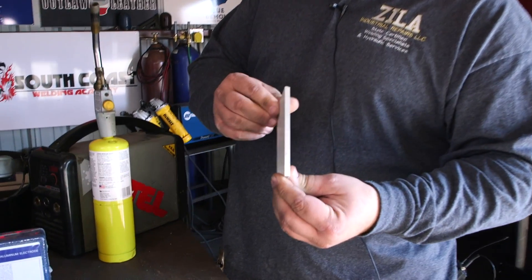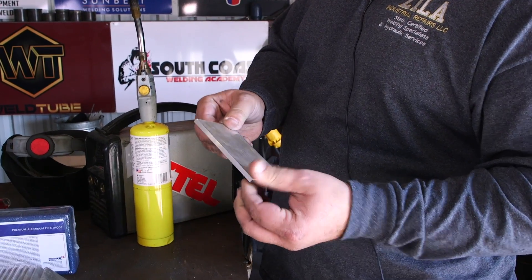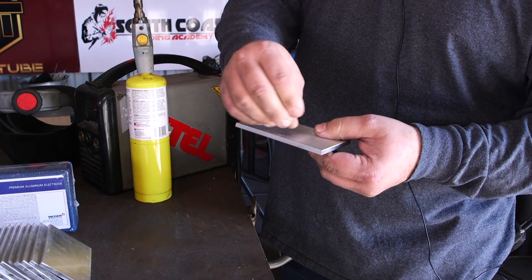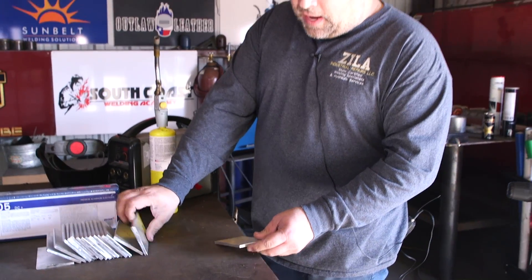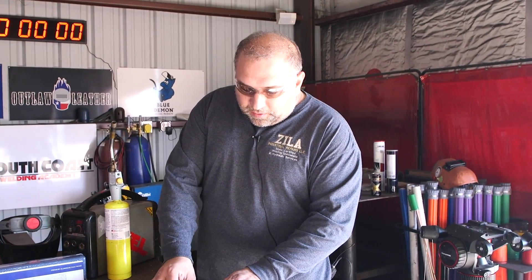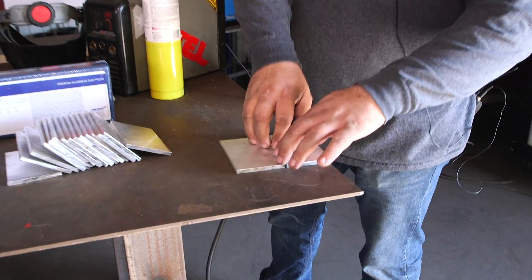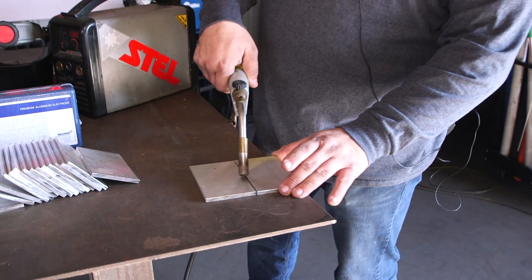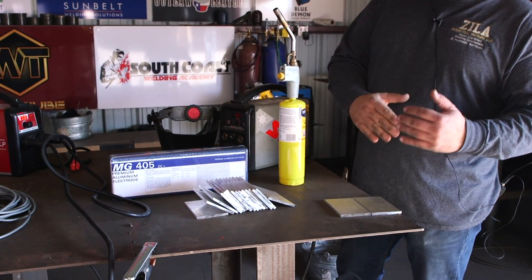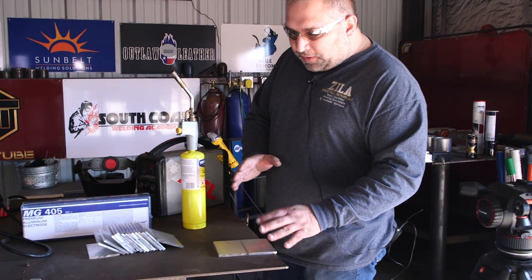Aluminum is not just an excellent electrical conductor, it's also an excellent thermal conductor, which means as you weld, the aluminum tries to suck the heat out of your weld area. If you weld on a big tanker truck, not just on a little coupon, you need excessive amounts of heat to keep your puddle liquid. You can preheat with a torch. The key is consistency — you should know what temperature you're preheating to, so a heat crayon like a Tempilstick could be your friend.